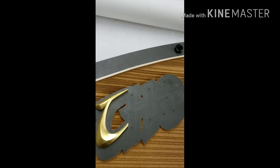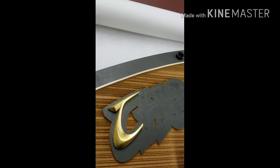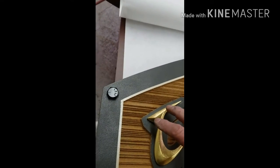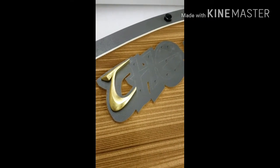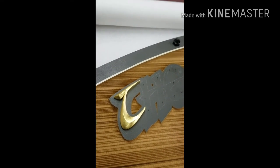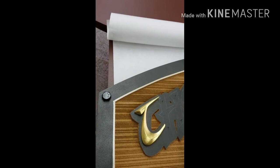So we have the double-sided nails into the surface, the sharpest side pointing out, dullest side going in, and then we've taken the letter with silicone on the back and pushed it down over those nails so it lines up with the pattern here. And that's how you get those things lined up, and the pins, the nails with the heads clipped off, are your guide to go down there, and the nails grab that letter just good enough to get it nice and tight to the surface. And that's the way this is done.